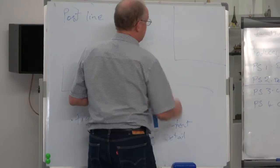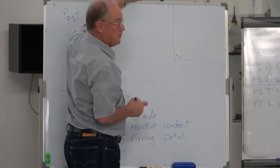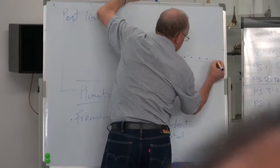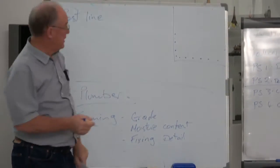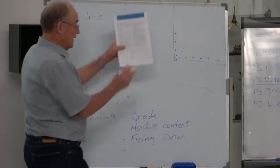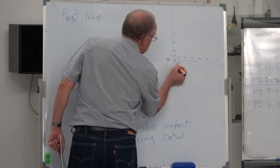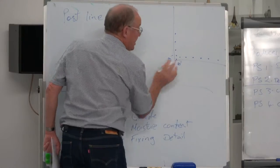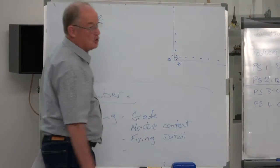Be very careful when it shows you a sheet of Gib board and it clearly shows 50 mils up and 50 mils in is where the first fixing is, and the fixings are 150 centres. I have been to so many building sites and the first fixing I see is there, when clearly in Winstone's book it says 50 millimetres and 50 millimetres. That fixing there will break out when the sheet's working hard under high wind zone or an earthquake, and it's useless.